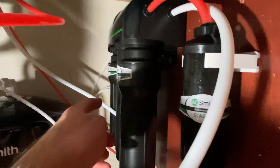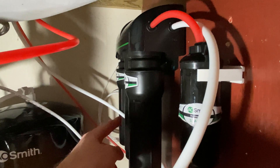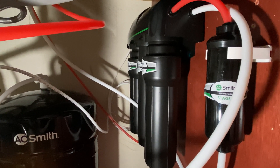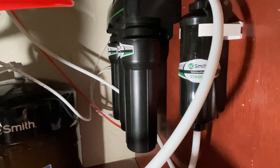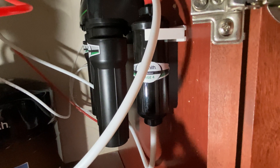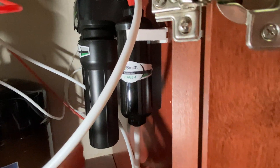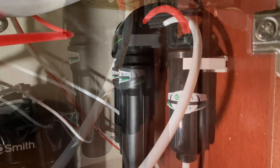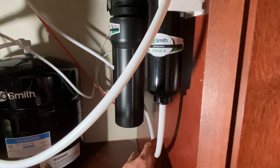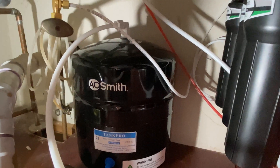It'll get filtered into the second filter, then into the third filter — typically a membrane. In each of the filters, it's going to be filtering the water more and more as the stages go on. Some filters have two, three, or even four filters. This one has three filters and has a remineralizer, which is right there. After that, from the remineralizer, you're going to see a hose going into a storage tank right here. This looks like a five-gallon tank, which it is.